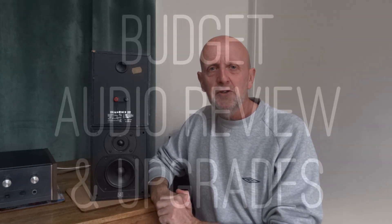I went on the internet and found pictures of these speakers to confirm the correct terminal positions — checking a few images just to be sure, since having them in the wrong position obviously means they won't sound right. So that's what caused the focusing problem, and once I swapped the terminal back, I could do a proper review. The lesson here: when buying speakers off eBay, make sure the connections are right — it's something you don't always look at when you're eager to plug them in. Just be aware that someone might have done a silly trick and swapped the terminals over, and then claimed the speakers sound fine because some sound was coming out.